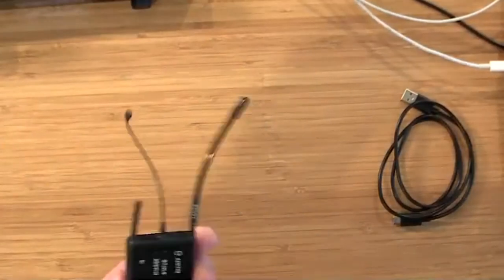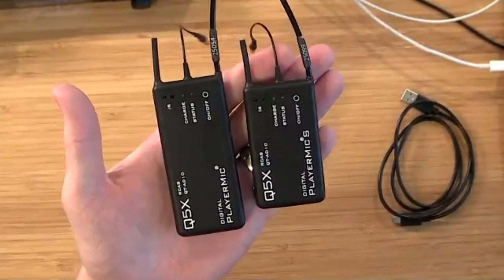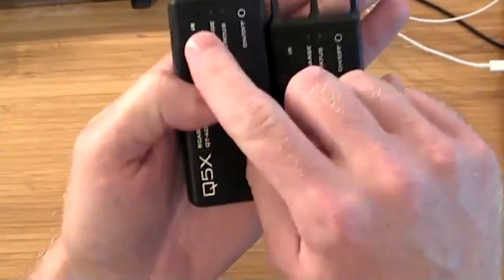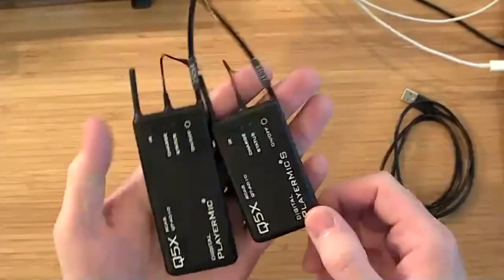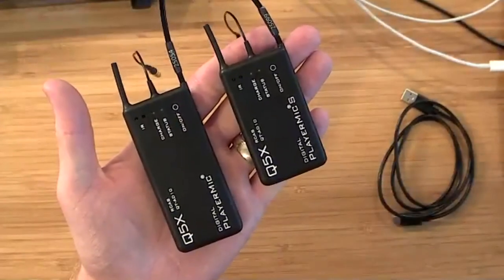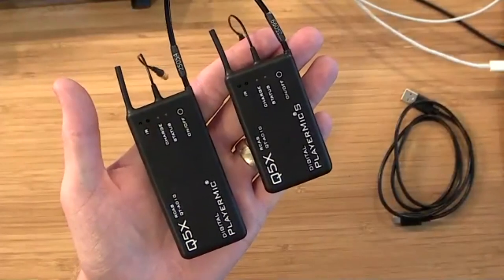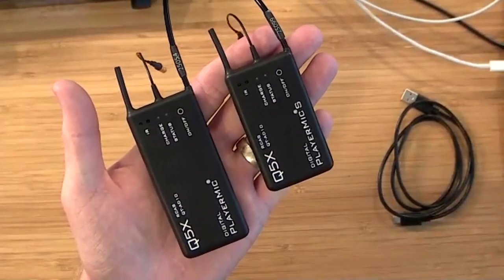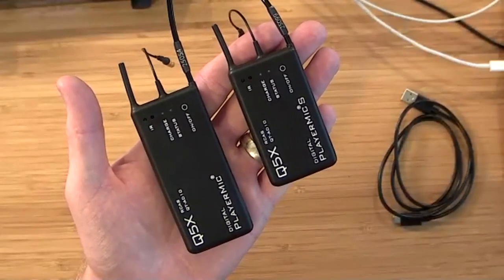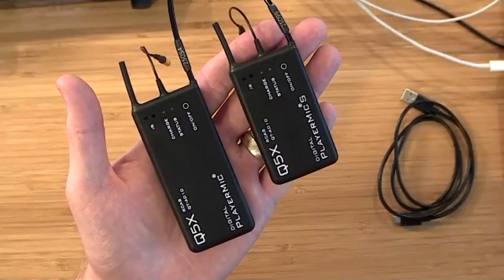And then it's got sync capability as well. There's the IR port on the front, so you can create the settings on your Axient Digital receiver and sync that over. And there are on and off power switch buttons on the front that you can see. So previous Quantum transmitters, if anybody here is familiar with them, you actually had to have a mic commander to even get the unit to turn on. It's not the case with these. However, it does offer a lot of functionality in terms of RF muting, putting them to sleep, saving battery power, changing frequencies, all the things you want to do on the fly.